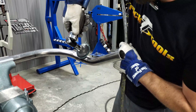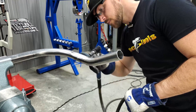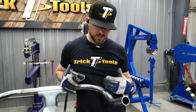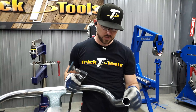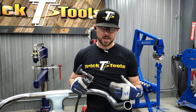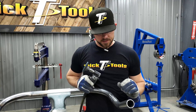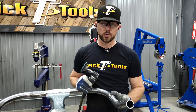Now the fine scotch-brite. The reason for stepping up grits is to help blend the surface together and work out the scratches from the heavier grit discs so you have a nice finish. In most applications, this would be ready for the next step - for most powder coat or paint situations you're not going to really see the visible spot where you welded and sanded it all out.